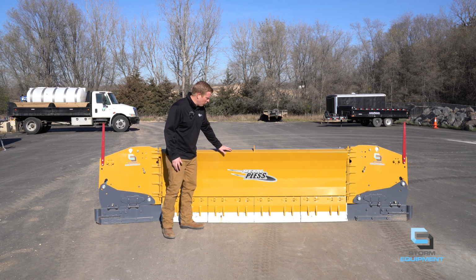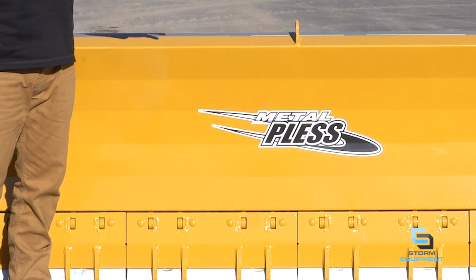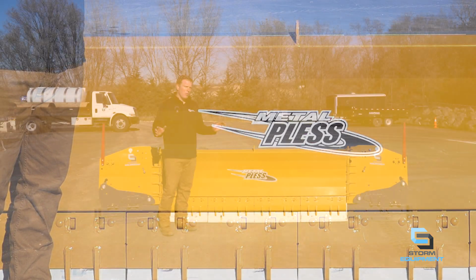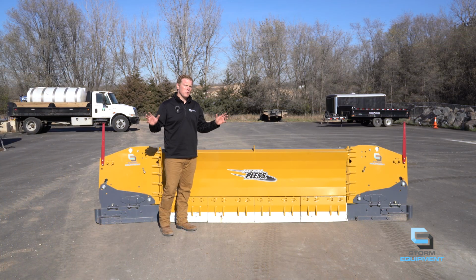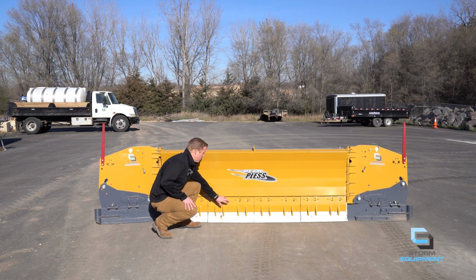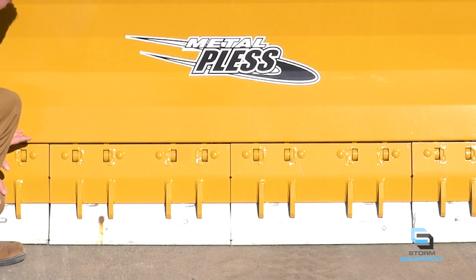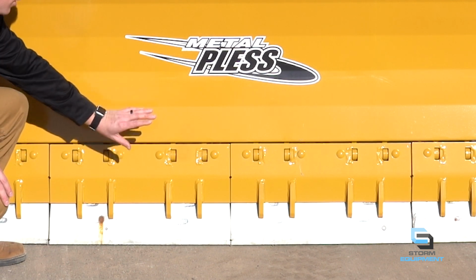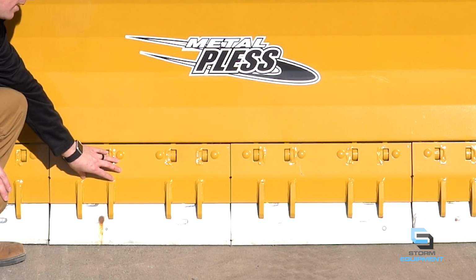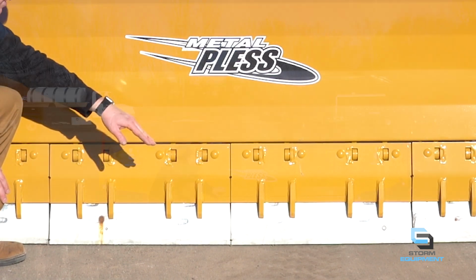Starting at the top of the moldboard, you'll have the unique curvature of the metal Pless moldboard. This will roll snow to a certain point, and then you'll have mountains of snow in front of this plow. Moving down the moldboard, you'll see this first division in the moldboard. This is the HD soft trip. So there are 2-foot sections across this moldboard, all independent of each other. If something were to strike the HD soft trip, it will pivot straight back and reset.